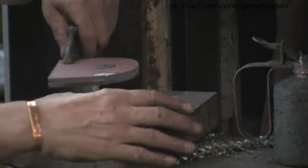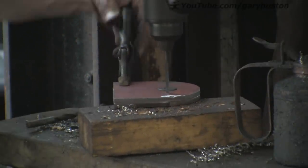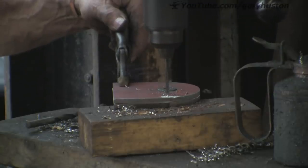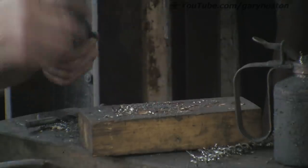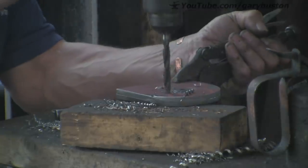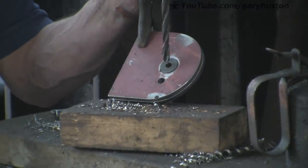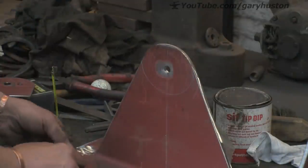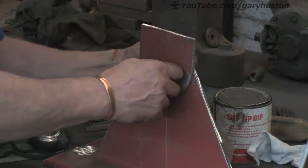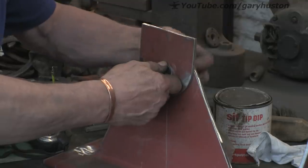So what I've done — I've just bolted these two back together, because I should have put this hole in whilst they were still joined. Of course I forgot about it. So I'll just put a bolt through the middle there and I'm just putting in a 10mm tapping size because I'm going to tap that out to the size of that machine handle. Let's bolt it up and have a look to see what we're going to be faced with.